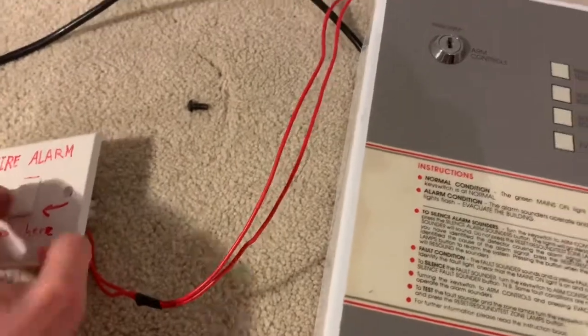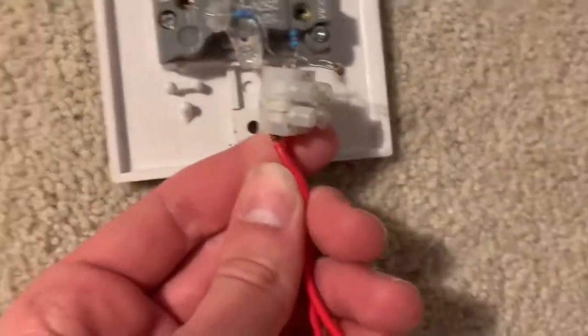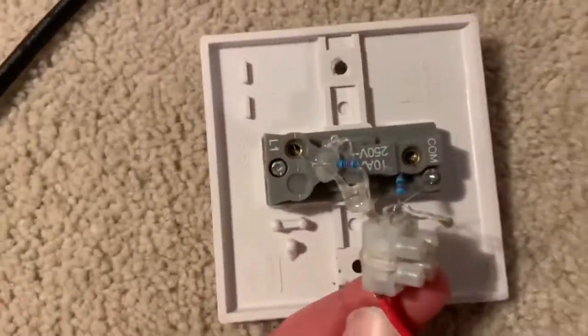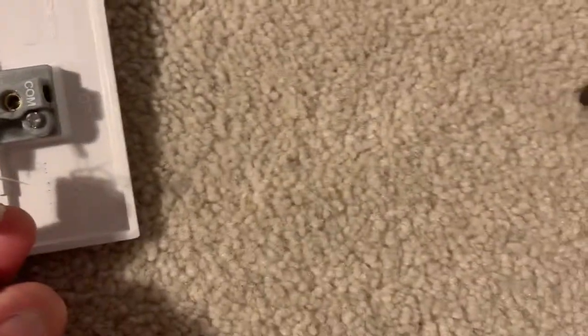Fire alarm people, you probably already know this, but there's the resistors. I know it looks a bit of a mess. The wires go in through that 6K ohm resistor, which is to make sure the fire alarm panel doesn't go into fault. And there's two 200-ohm resistors. If there's a 400-ohm resistance across the zone, then it goes into alarm.